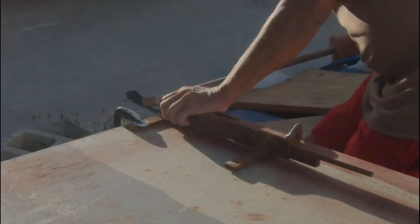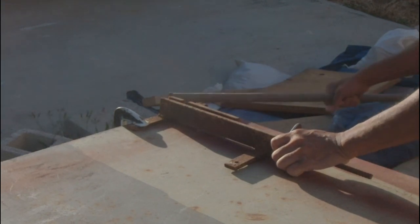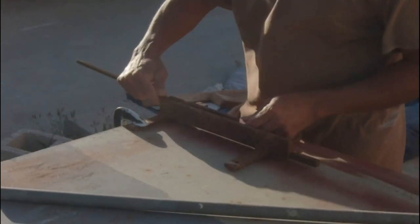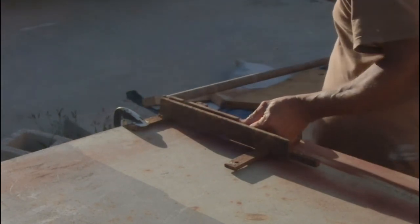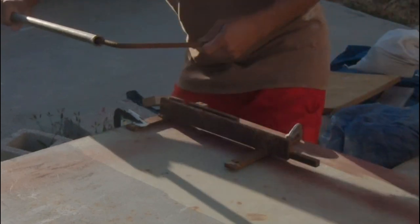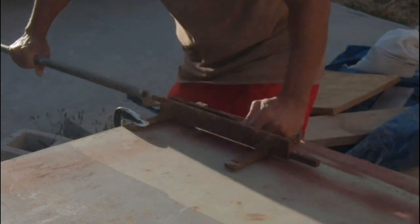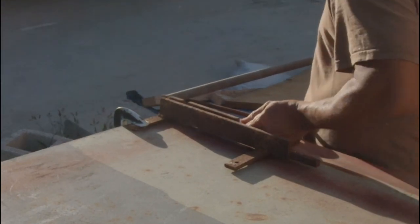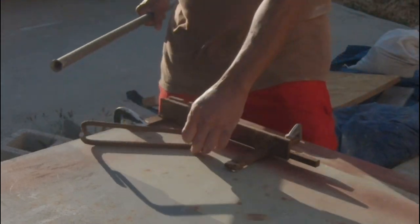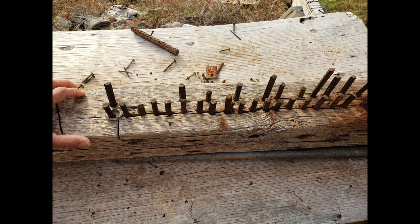Okay, this is the first bend. Easy, very easy. Right. Coming to the second bend. Now right here, that's the long part, about 8.5 inches. Second bend. You come into the third bend, which gives you the 3 inches. And then finally, in this case, the 4th bend. After this, you would have been able to put it within the 3-inch groove and give it the 5th bend. Perfect for 6-inch blocks. Sorry, I'm not going to touch this thing.